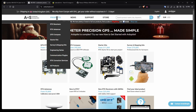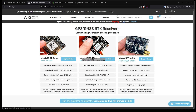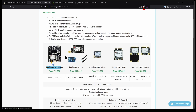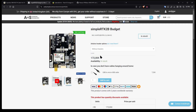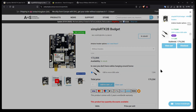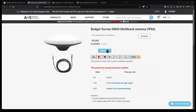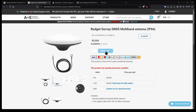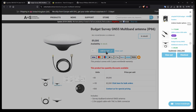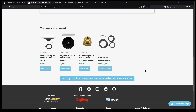First we'll order the GPS and antenna. The models we recommend in this video are what most people use, so if you decide to go off track and get something different, be prepared to have issues. The GPS is the SimpleRTK2B budget, and we order it without connection headers, and we'll take a micro USB cable as well. Then we add the budget survey antenna — it comes with a 2.5 meter adapter cable, so we don't need an additional one, but there's a link to an extension cable which you will need.